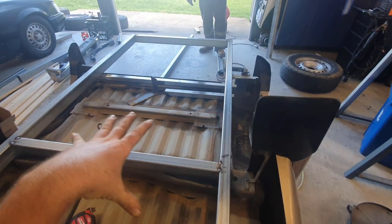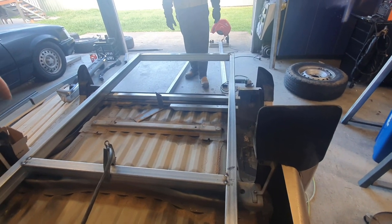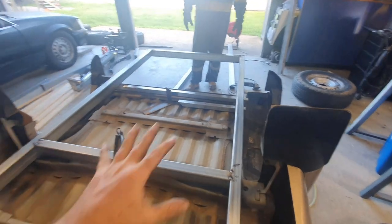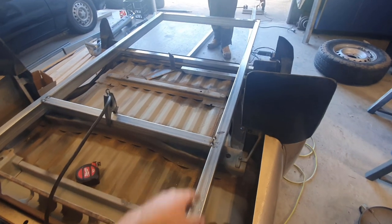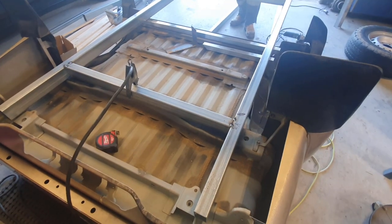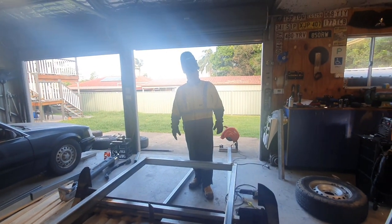And then once that's all pinned, we'll center up our axle kit to where we want it, tack that, and then we'll probably even do our drawbar, and then tack all that in, and then pull it off the tub so we don't destroy it. We're getting a little bit of splatter on it, but it's... What was this, a 2008? This is already a 12-year-old bloody tub. No, 13 years old. Time flies when you're useless.